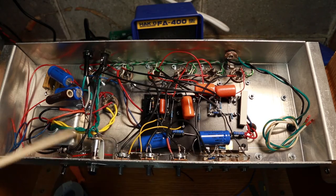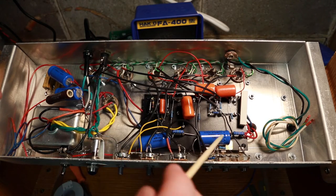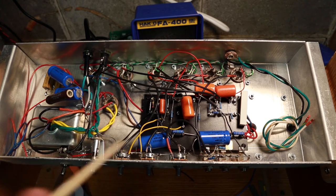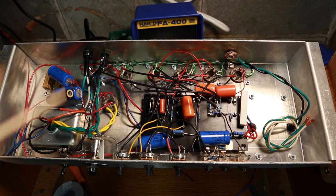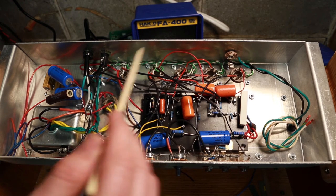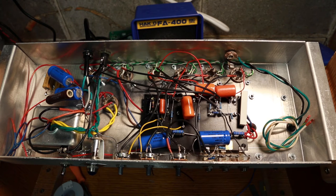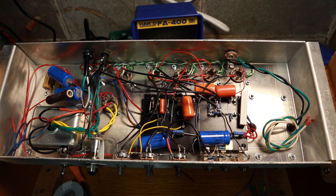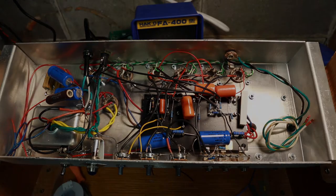I can check the C point and the D point as well, just to see where those voltages are at as I bring it up. I'll bring it up to maybe 30 volts, see what it looks like, then 40 volts, etc. If everything looks good on the variac then I'll shut it back off, plug in some tubes, hook up my current limiting bulb, and flip it on. It's always that first power-up that's nerve-wracking, but we'll let you guys watch it with me.